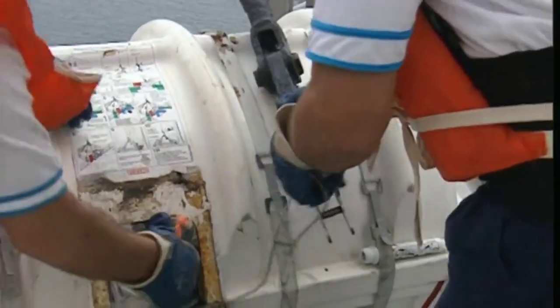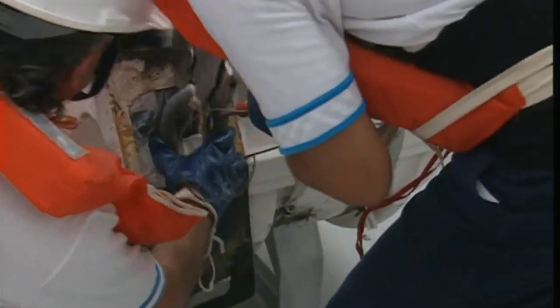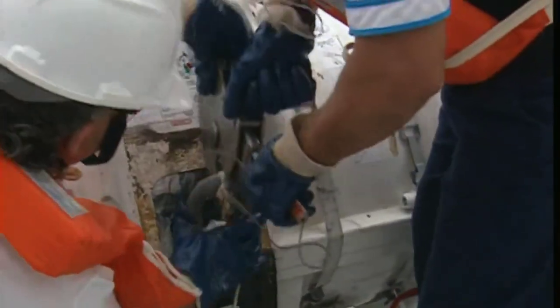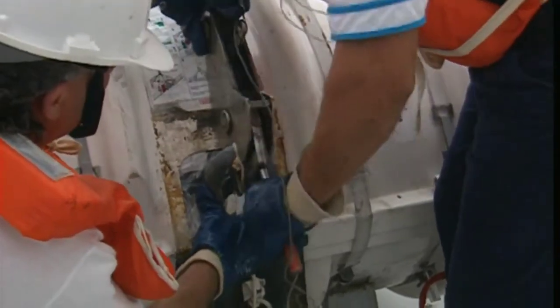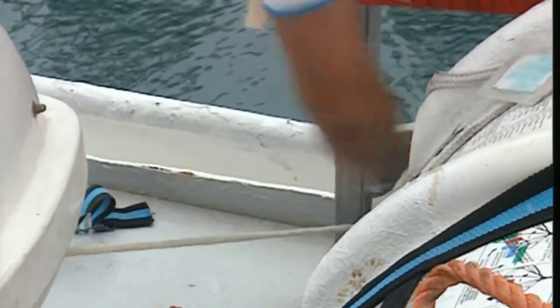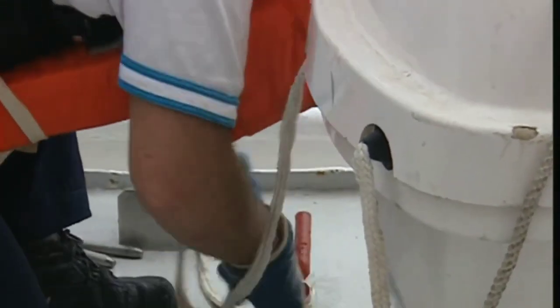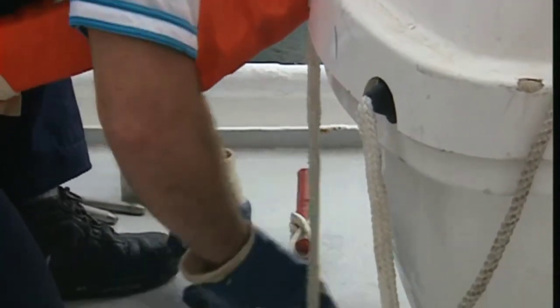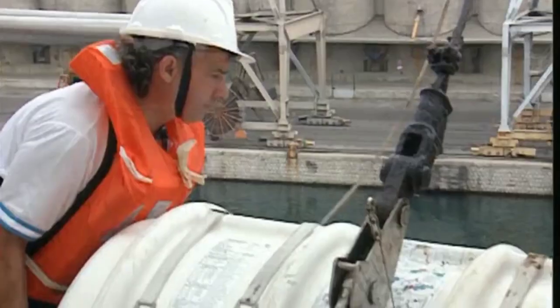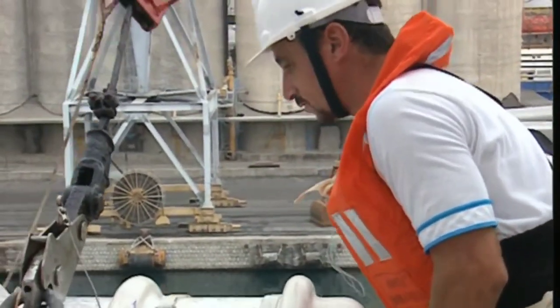The life raft shackle is pulled out of the canister, and the davit fall is hooked to it. It is essential to check that the hook mechanism is properly closed. Then the painter and bowsing lines are pulled out. Sometimes a separate line for inflation is provided, but here the painter is used to inflate the raft. All these lines are secured to appropriate secure points on the deck. Deck cleats are usually provided for this. Plenty of slack is left.